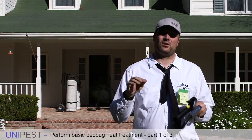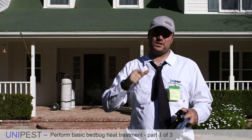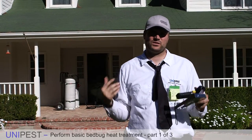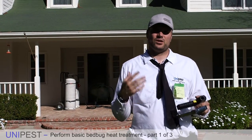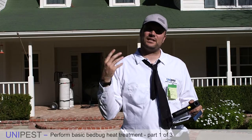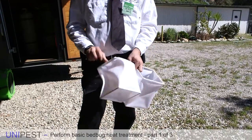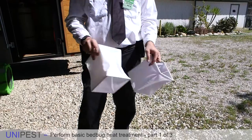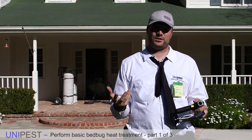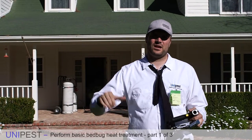Four times an hour — every 15 minutes — I'm going to go inside and check and measure the temperature of all of the objects in the room that I can. You don't have to spend a lot of time in there. Stay hydrated, bring tons of water. But every 15 minutes go in there and try and measure these spots. This is really important because you also want to make sure that some things do not get too hot — if some devices get too hot they will melt. You can see these lampshades from a hotel that we unfortunately melted because they were in one of the hottest parts of the room, causing damage. You don't want to delaminate some furniture, and you want to make sure that some plastics are not harmed. So, every 15 minutes, go check the temperature.